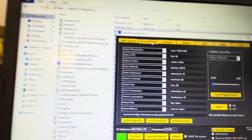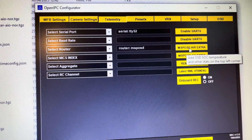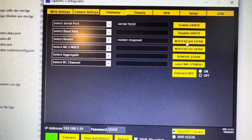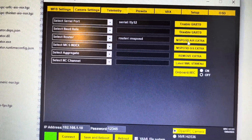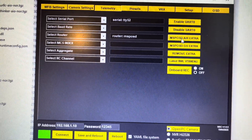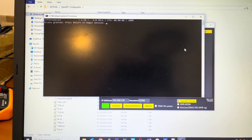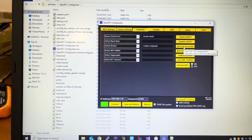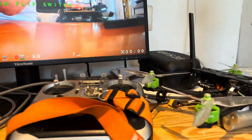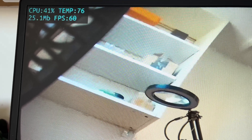What we need to do is go to Telemetry and hit the MSP OSD Air Extra button. This button will add some extra OSD data that will show us the actual video bitrate, the temperature, the CPU load, and the frames per second. Let's press it — Return, Return — and that's it. It will reboot, and after the reboot you will have the video bitrate, the temperature, the CPU, and the frames per second displayed.